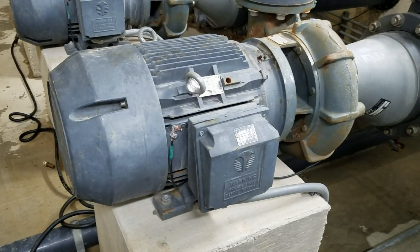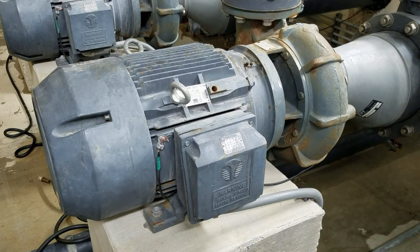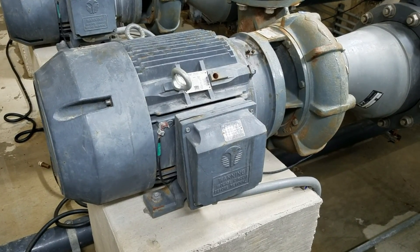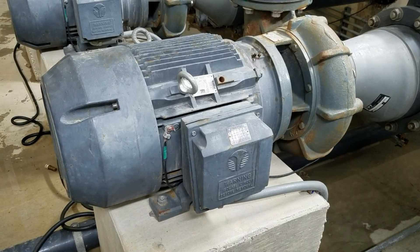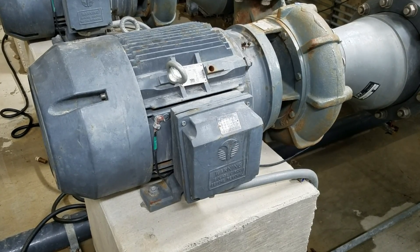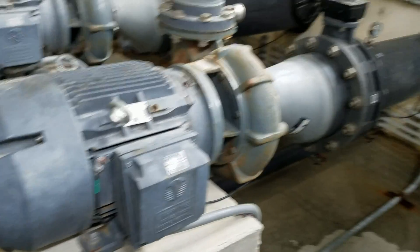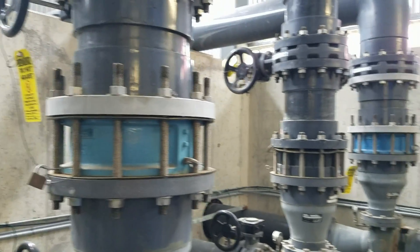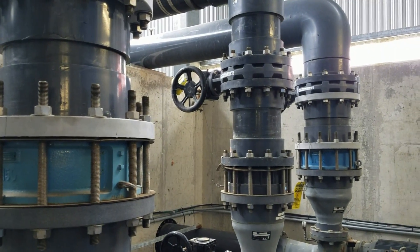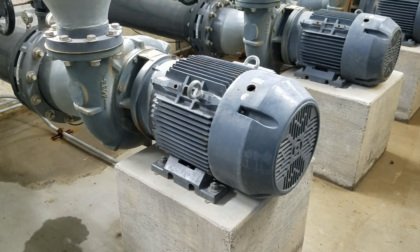Nonetheless, good motor, good pump, does well. I'm pushing them with VFDs. Some of these pumps are running at around 80% capacity. I'm able to do that with the VFD itself — I don't have to throttle down. So all these valves here are open 100%, and we only throttle down using the VFD itself, which is really nice because then I can save my motor.